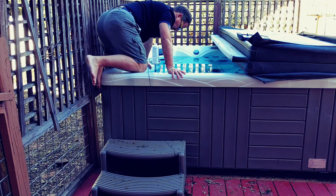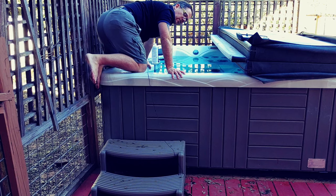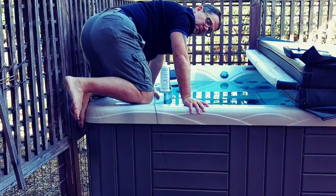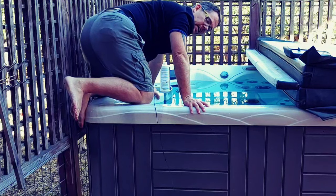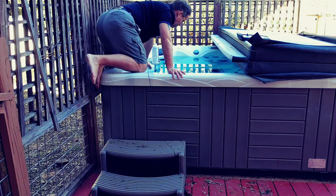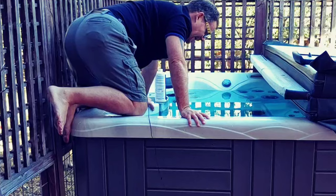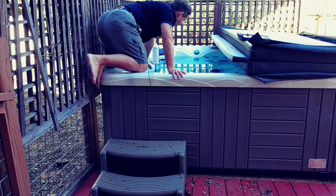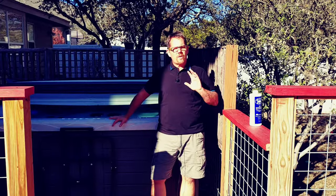Leave the filters out and let the hot tub sit for 24 hours. Mark the water level with a dry-erase marker so you can tell if it continues to drop. If the level is steady, put the filters back in — you don't need to drain the water before using the tub again. If the leak is slower but not stopped, repeat the process with another quarter bottle and wait another 24 hours. If it's still leaking after that, the crack is likely too large for Fix-a-Leak, and you'll need to tear out some foam to locate and address the leak directly.